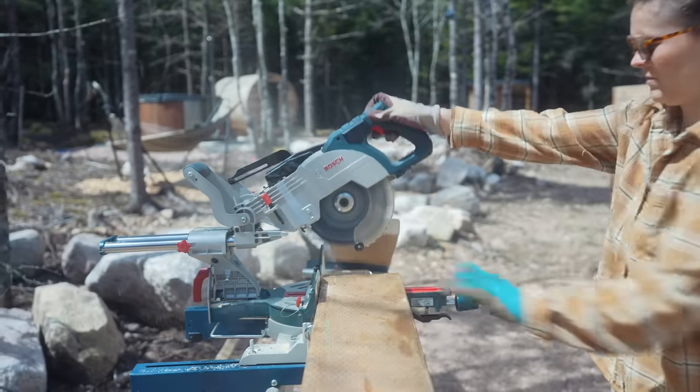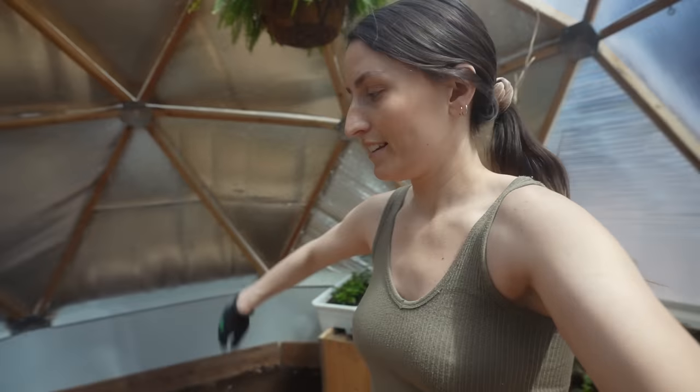We have now cut all of our joists, which are gonna lay this way. We're just gonna put those in with framing nails as it is a floating deck. I'm not gonna use joist hangers in this because I don't think it's necessary at all. Let's start by putting one piece down, leveling it with the material we have because we will need some, and then we'll keep going, and if we have too much, then we'll start to take it out.